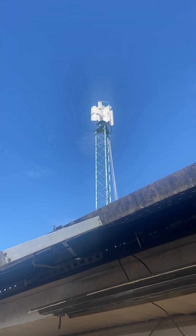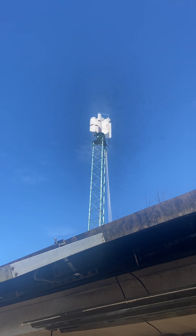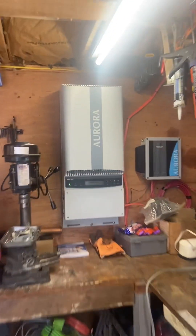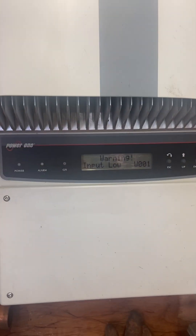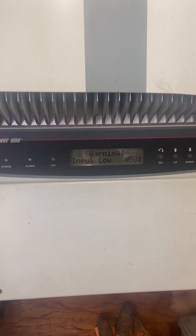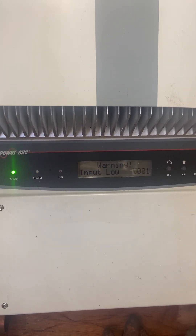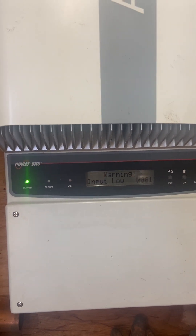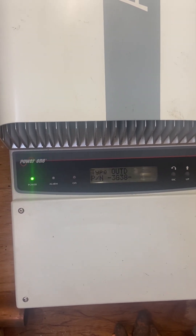I have to hit 50 volts to make mine kick on. Right there is a hand spin — there's a burst — so that burst will get this to come on. Power on, low input — yep, below 50 volts — and then unless the winds kick up it's going to kick out and shut off.